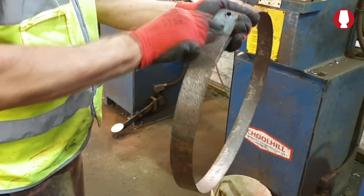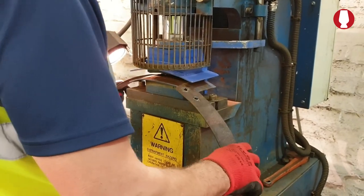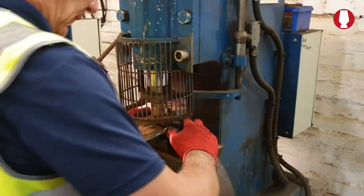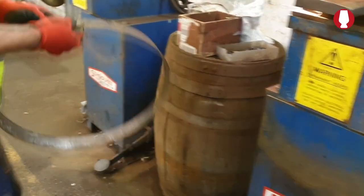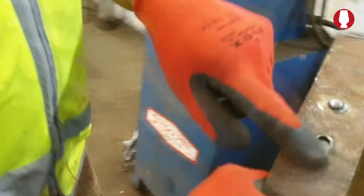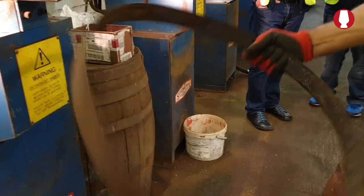But you notice it leaves a small lip on the edge here. This machine flattens it. We now have the smooth parts. We move it over two holes and we punch the hole back in. The rivet goes right through the hole. And it should come out re-riveted. Same in that one. And that's what you'll get. Two rivets being moved back across again. Right, don't need that.